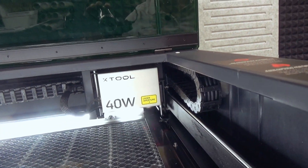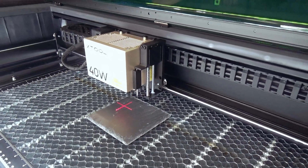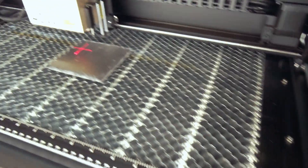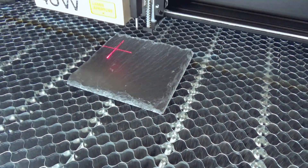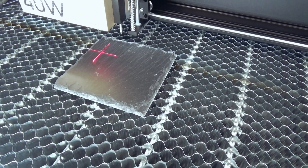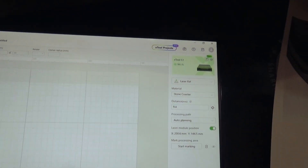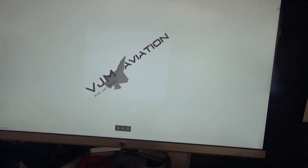Let's frame it. The next step is to calibrate the thickness of the stone, so let's push Calibrate. Amazing — now it knows where the focus point is. The next step is framing, so let's push this button. It's pretty well aligned — let's try it again. That looks awesome. Let's close the lid. Now framing is complete, and we'll select the stone coaster preset. These presets are already there — this is what we're going to make — and then we press Start.